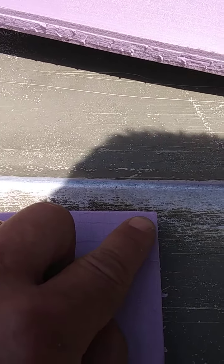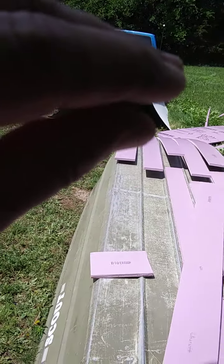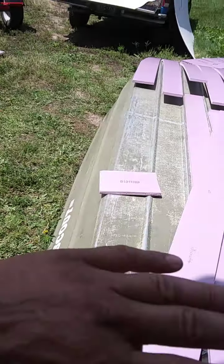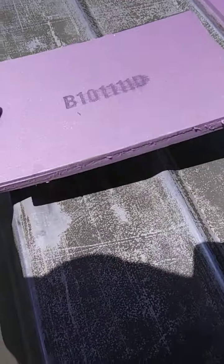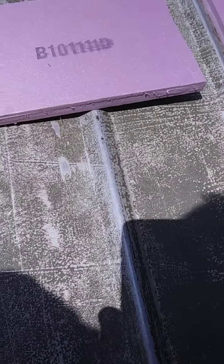This stuff is 25 pounds per square inch — from here to here, it takes 25 pounds to smash that down and get it compressing. So over the whole bottom of the boat, figure out 25 PSI, 25 pounds per square inch compression strength that it'll take with nothing on it. With that plastic, it's going to spread the load. A square foot is 144 square inches — that's 3,600 pounds it would take to squish that foam in an area of 12 inches by 12 inches.